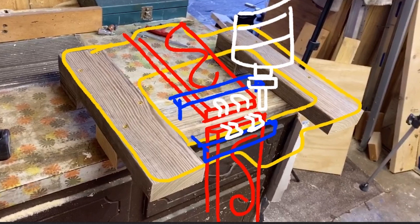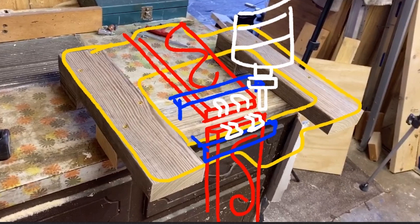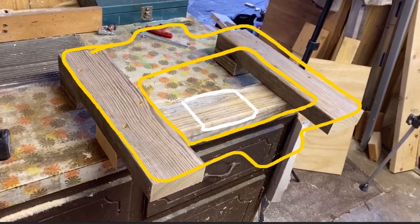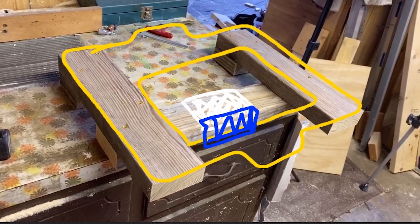The one issue I'm going to have is that these 2x4s have been sitting out in the rain for probably a couple of years and they're all warped with uneven surfaces. So if I clamp my wood to them now, the wood is not going to be sitting exactly straight compared to the HandyBot. In order to ensure that the wood is sitting straight, I'm going to need to surface the jig with my HandyBot — cutting a pocket on the top side of this 2x4 and also into the side, so that both surfaces to which I want to clamp wood are ensured to be flat.